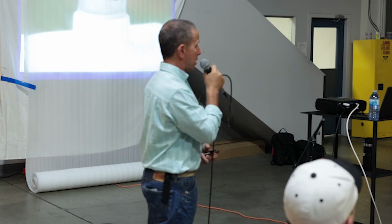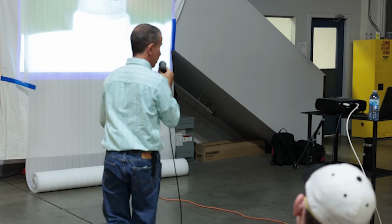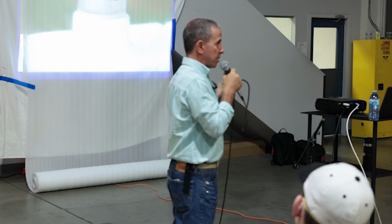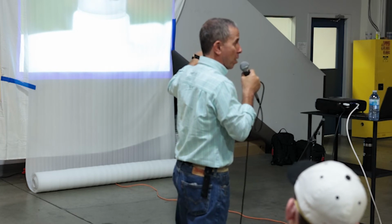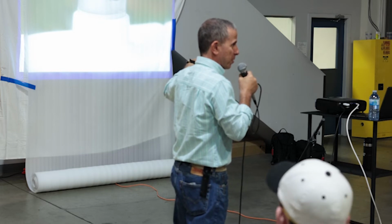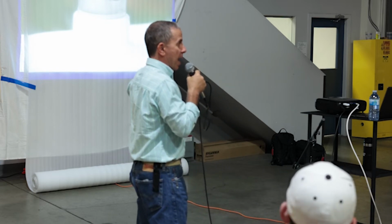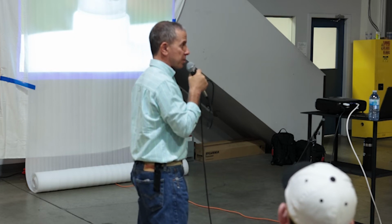Is there a question? In that example right there, you could have the paint line like half an inch away from that. You could, yes, you could. That's a perfect example. So you could do away with the paint beneath that, have a nice sharp edge. Cleats are the most common area where you see this. In that application, what I would do, I like the bushing in there. I would bed it as well, because water, interestingly, is going beneath the bushing and exposing itself to the paint. So if you can keep the water out completely, that's going to hold up fairly well. And you can do that with a combination of a bushing and bedding. But a cleat, you don't have that choice. So yes.